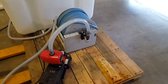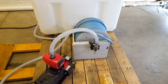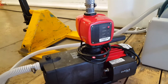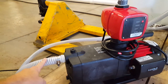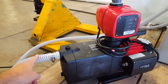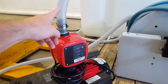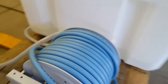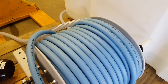Hello everyone, this is Midwest Washington Equipment getting ready to do a test on our one horsepower booster pump. One inch inlet suction hose — this is very important that this hose does not collapse; you need to use a heavy-duty suction hose. One inch outlet going into our hose reel, which has 200 feet of 5/8 inch flex tech spray hose.